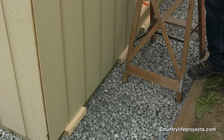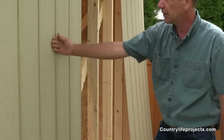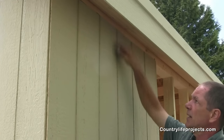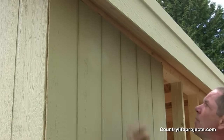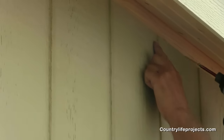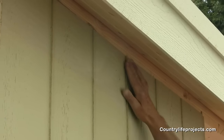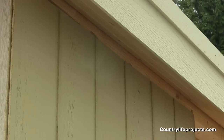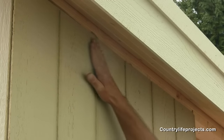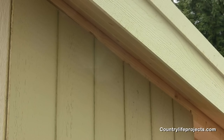Our panel is in place and pretty much nailed off. We always start from the bottom because we have our blocks as a guide that we installed earlier. But as you get to the top, if your panel is warped, it's difficult to nail in that area, and chances are your nails are going to pop or you're not going to be able to nail it on properly. So what I do in this situation is just screw — no more than 3/4 of an inch down, go up on an angle — because you want to screw into the top plate. Since we're in the groove, when we put our trim on later it won't interfere. It'll sit nicely on the panels. I would recommend doing one in every groove. This needs to be fairly flat so that your trim sits on here nicely when we're doing the final stages of the shed.